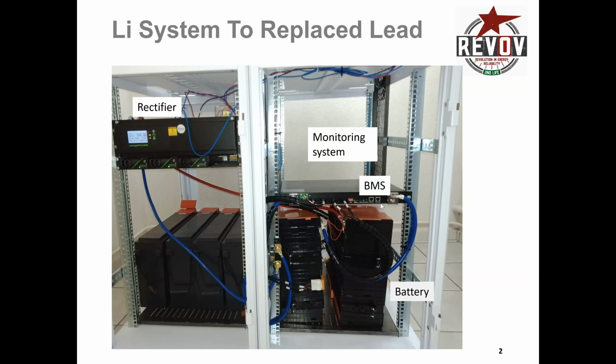The negative current would then run through the inside of that BMS and come out on the other side, the left-hand terminal, and go on up to the rectifier or the inverter. And then you have a little green plug here, which is the positive connection cable, which gives you the DC power to the system. That cable has a little brown cable that connects across to the positive terminal on the second battery as well, because you want to have a 48 volt system there.